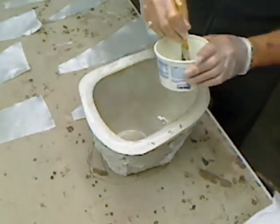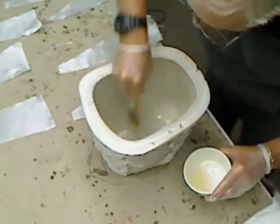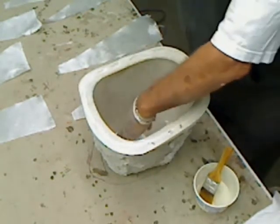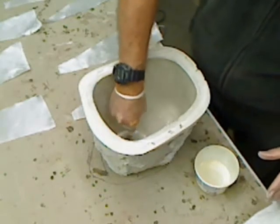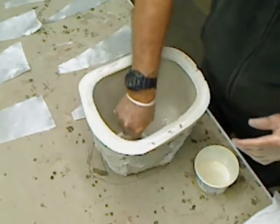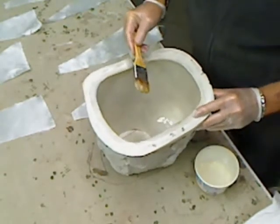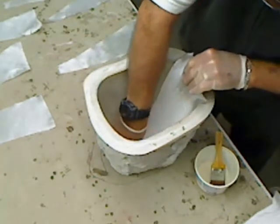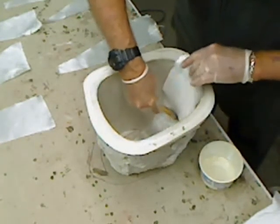It shouldn't take too long to lay out because it's not all that big of a mold. First thing I've got is a little circle here — the nose piece — put that down there. You always get a good buildup of resin in the bottom of this mold because it flows down there, so around these corners you can see there'll be a good buildup of resin as we progress. Okay, first strip — start this down here about in the center with our brush, just work it, smooth out all the wrinkles, work it up.